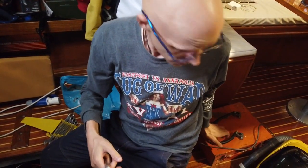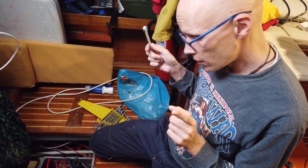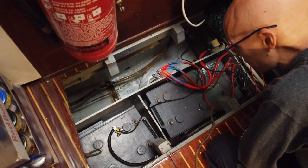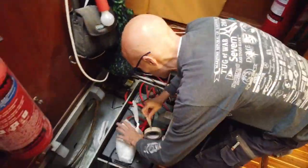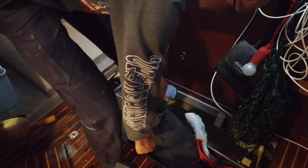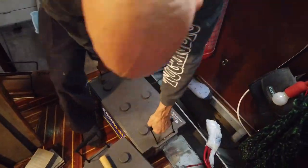That was the connection between the two batteries making a 24-volt battery out of two 12-volt batteries. Next, we have to make sure that those two don't touch each other, otherwise you'll short. Our boat is set up with a 24-volt system, and the cabling was previously not put in to the highest standards. So we had a fair bit of rewiring to do, and also added a few bus bars and fuses to the equation.